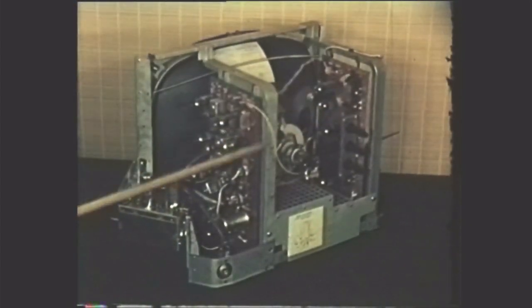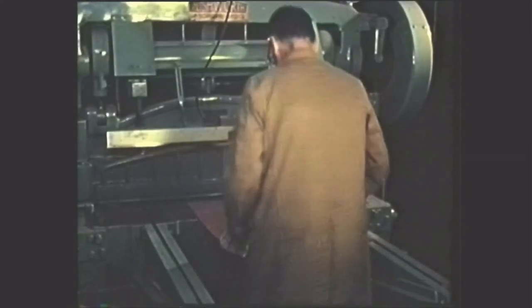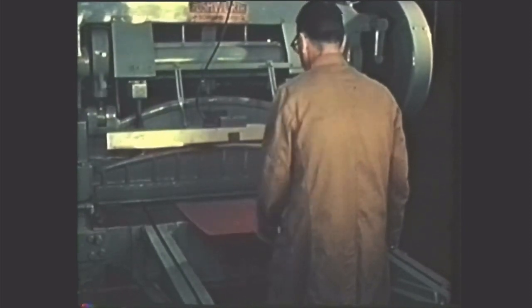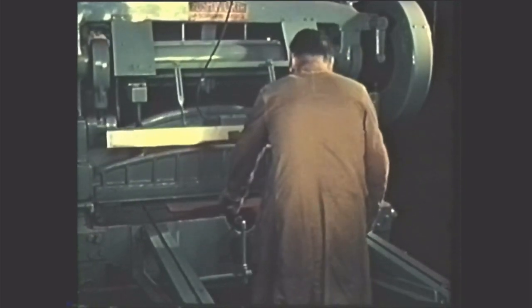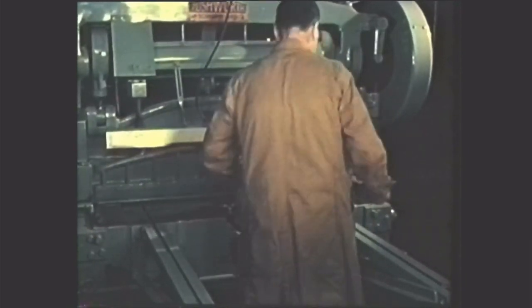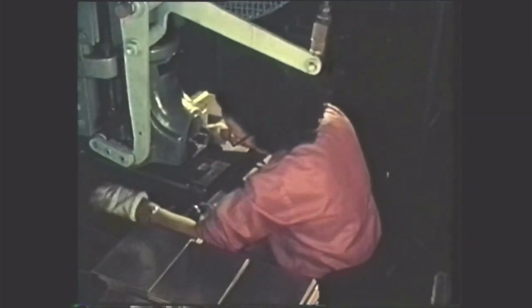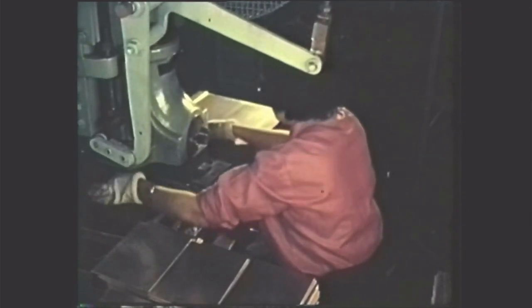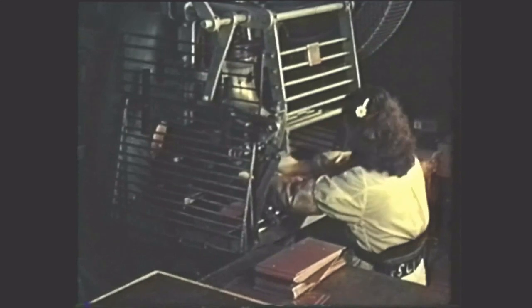The backbone of the new receiver is a pair of printed wiring panels. The material for the panels, which is copper clad laminate, arrives in large sheets. These are guillotined accurately into long strips, taking care not to damage the thin copper film. They are then cut to the size required, and indexing holes are punched, leaving the panels ready for feeding into the subsequent processes.